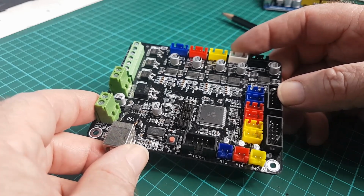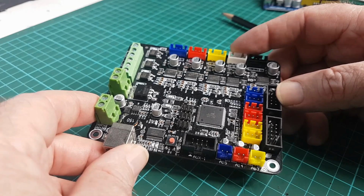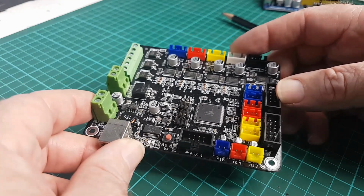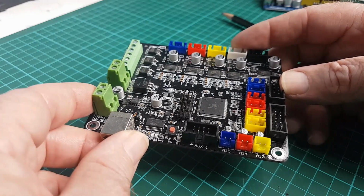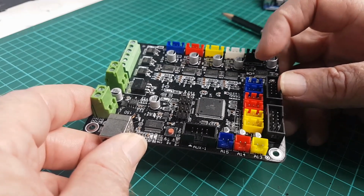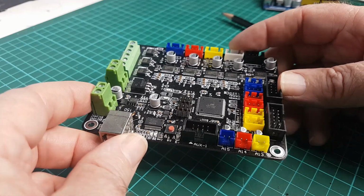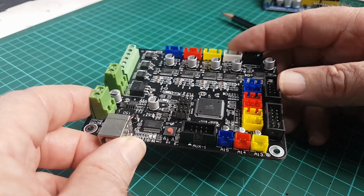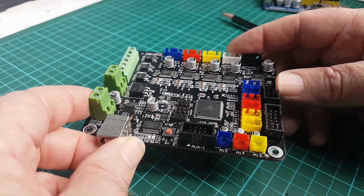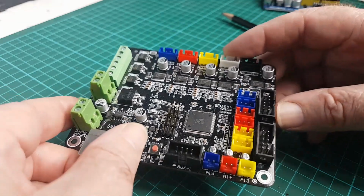in the machine, because with a focusable laser, to keep the focus point where you want to cut, you've got to move the actual job that you're cutting upwards, so that the laser focuses into the bottom of the kerf that you just cut. This is how, with multiple passes, I'm hoping to be able to cut through relatively thick material. Not super thick, up to about 5 millimeters, I'm hoping. So there's my hardware choices.